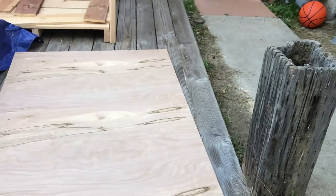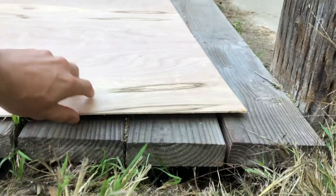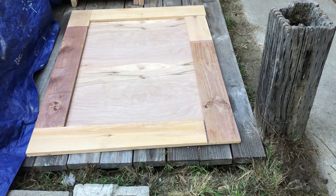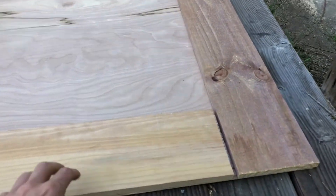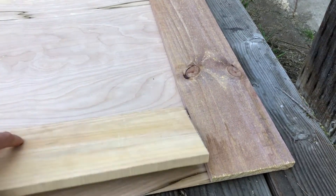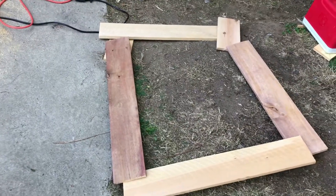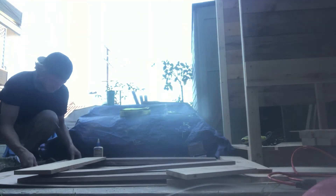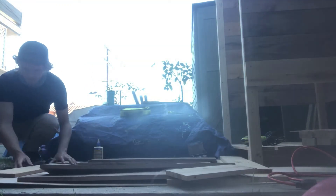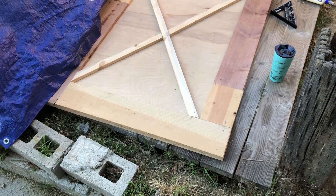Okay, the door. Take your thin piece of plywood and cut it 50 inches high by 37 inches wide — it's the centerpiece of the door. On each side of the door you're going to have mix-and-match cut pieces of pine and cedar however you see fit. My client wanted something funky so I did that. You're going to want each cut exactly duplicated so you have it on the back side of the door as well. Glue the bottom piece, glue the top, and drill it in with inch and a quarter screws.